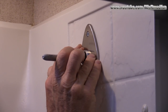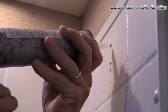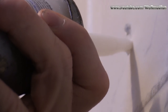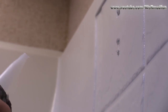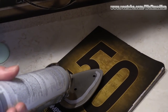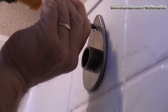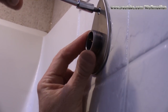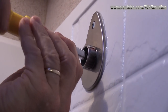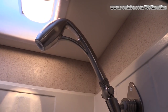We're marking it with a Sharpie, then I'll take it off and drill a hole. We're going to fill the holes first with some silicone just to be on the safe side — especially the hole we're not using. I was running the bead around it. This is probably overkill, but that's what we do. Look at that — a perfect bead coming all the way around, almost too much. That's all right, I'll go in there and fix that.